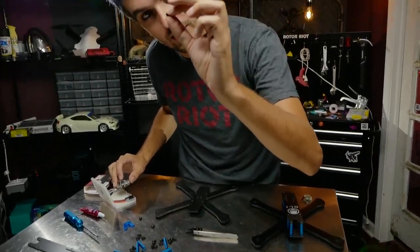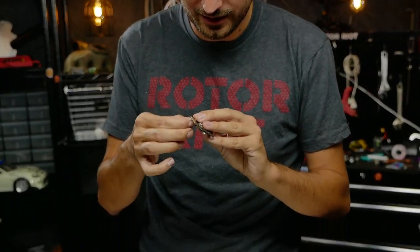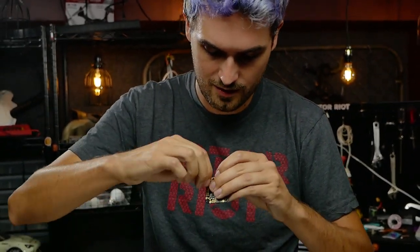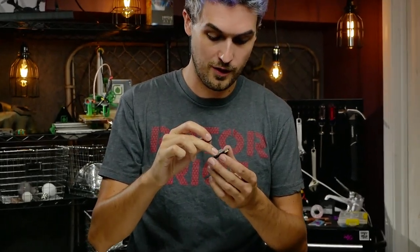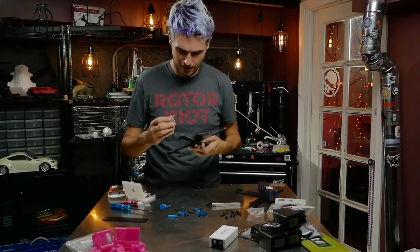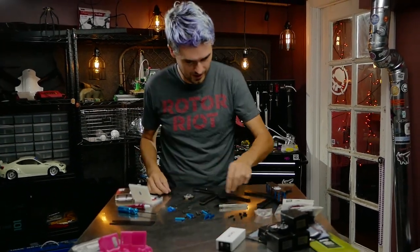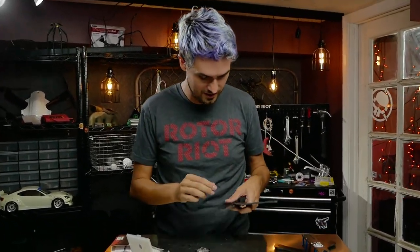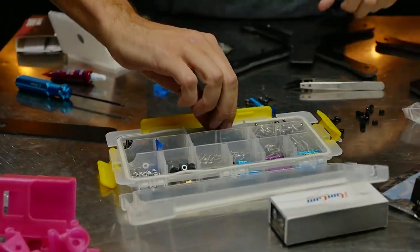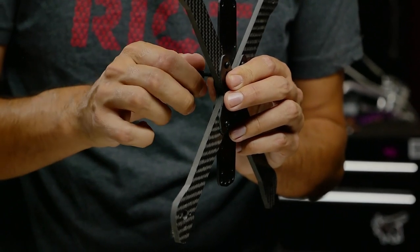In the hardware pack that comes with the flight board you've got soft mount gummies, a soft-mounted gyro, and a soft-mounted board — I've really been enjoying having two layers of physical dampening. We're going to put the soft mount gummies in the corners of the flight board. To mount it as low as possible, we've got nylon nuts and a small three millimeter nylon standoff. I like to use a slightly longer screw, threading the female-female nylon standoff down onto it.